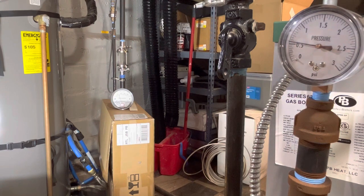And the cycle guard said everything's okay, so it's going to be good for another 15 minutes. Build the pressure back up. And there wasn't any water hammer at all. The system is totally silent. If I didn't know I had messed around with the boiler by putting this valve on here and by shutting off half my radiators, I wouldn't even be able to tell the difference, except if I was looking at the pressure gauges, then I'd be able to tell the difference, because normally this thing would barely make this gauge flutter at all.